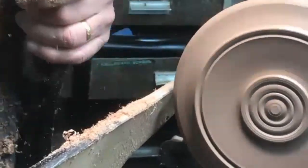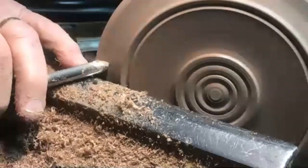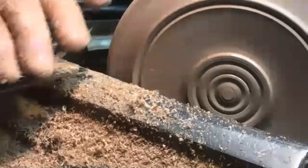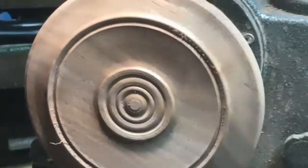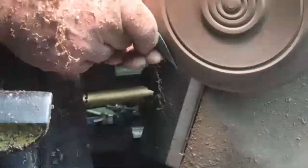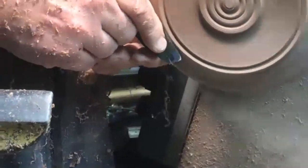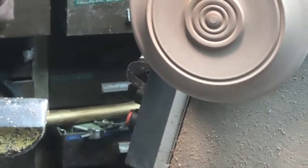I'm rotating my hips; I've got the tool against my body. Rolled it over and compare them - it's a little bit fatter but I might take just a little more out of this side. I'm only going halfway up - all I really care about is getting this to look thinner. A little 80-grit paper with the lathe not running too fast otherwise you burn your fingers.